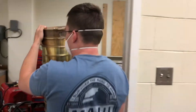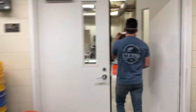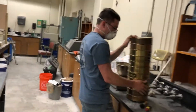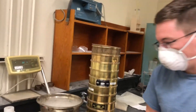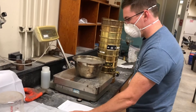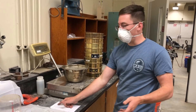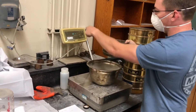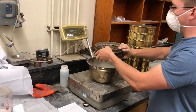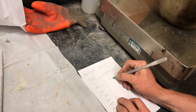And then we'll take it over here so we can weigh it. So if we're doing sieve analysis, you want to get a cumulative weight. So we're getting a cumulative weight, and at the pan we'll have the total weight that we had, which was 1,305 grams. So what we'll do — we have all this material, we zero our scale, and you want to get all of the aggregate. So 251 grams — that was on the 3/4 inch. 251 grams.